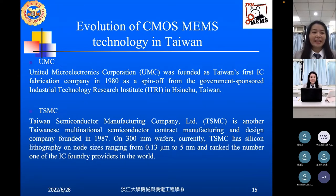In this case, I would like to mention the United Microelectronics Corporation, which was founded as Taiwan's first IC fabrication company in 1980 as a spin-off from the government-sponsored Industrial Technology Research Institute, also known as ITRI, in Hsinchu, Taiwan. TSMC is another multinational semiconductor contract manufacturing company, whose name is Taiwan Semiconductor Manufacturing Company. It was founded in 1987 on 300 millimeter wafers. Currently, TSMC has silicon lithography on node sizes ranging from 0.13 micrometer to 5 nanometer and is ranked the number one IC foundry provider in the world.